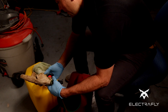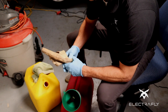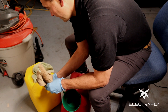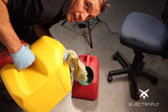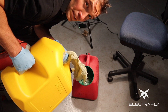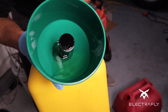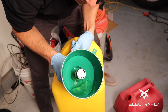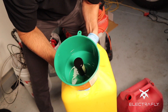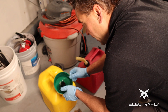We're going to use a container that's dry and clean, transfer it back once it's been filtered. Take all the fuel lines out, put this one on, and give it a shot. This is diesel, by the way. It looked pretty clean at first, but when I got real close I could see a couple little hairs and flakes in there. Any dirtiness in the fuel could lead to a clogged line and an engine failure. The filter is held up about three quarters of an inch from the bottom of the funnel.